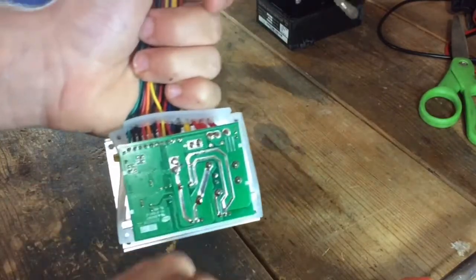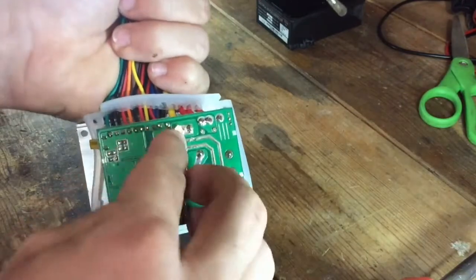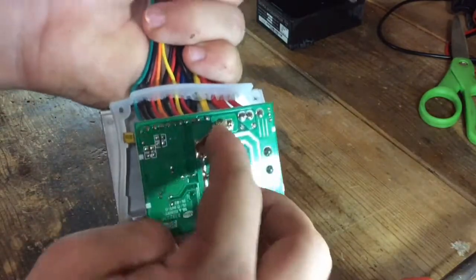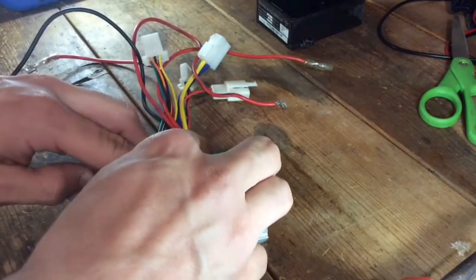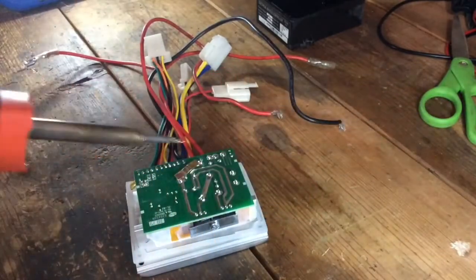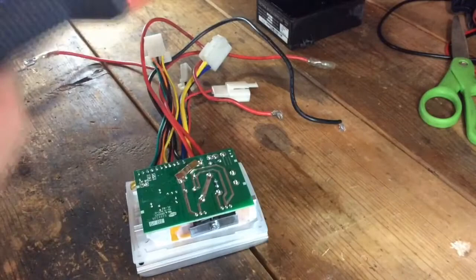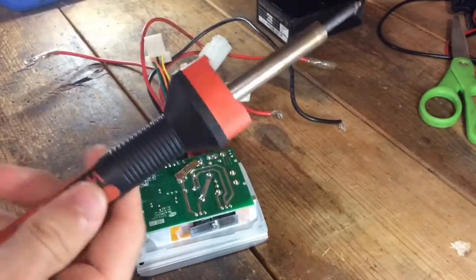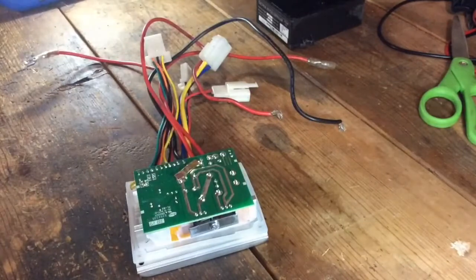What you need to do is take a small piece of metal — you have two centimeters of brass here — and then you can glue or solder this on. The first and preferred option would be soldering. If you have a soldering iron, go ahead and solder that on — it's the best, most reliable connection. If you don't have one, these can be bought for about 20 to 30 bucks at a hardware or hobby shop. If you're not going to buy one and you don't feel comfortable soldering, then you can move on to adhesive.